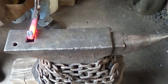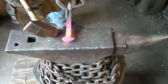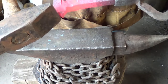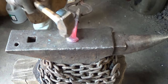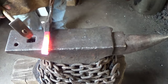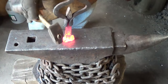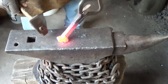I drop that right over the hardy hole - that's the best edge I have - and I just kind of drop that down to pick up a little more steel. Now this poor spike has something there that's gonna cause me grief. We got to work that steel back - I can't have that little lip there. Some of the spikes do that. We'll spend a little time cleaning that up, drop that nose a little more. Each spike has its own little personality - sometimes you gotta change up your plan a little bit.